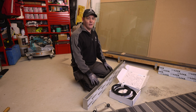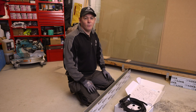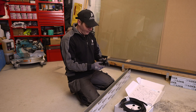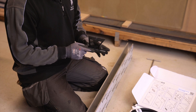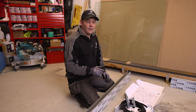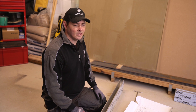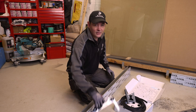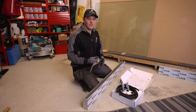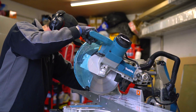However, this system does have some downsides worth mentioning. You don't quite get as much adjustment when levelling the glass as you do with the Posiglaze and the Easy Fit, and the sliders for the glass shoes — although they're a great idea — do get quite sticky, especially with a heavier piece of glass, and they don't slide in well with the fitting tools. We lubricate them with Wurth 2040 or a PTFE-type lubricant, which helps, but with a really heavy piece of glass it's quite tricky. The slider tool is also quite flexible, and when you've got a sticky slider it can slip off the track. We often use the puller tool as a persuader to knock it on before we can get the glass levelled.